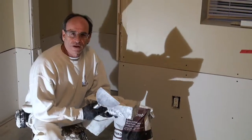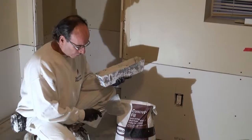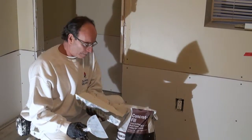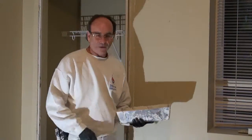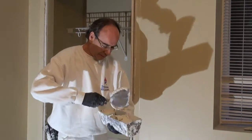I've got another video which covers mixing up this product here — concrete fill. What you need is a pan and a six-inch knife, a mud pan. I use about 90% concrete fill and about 10% regular mud so it's a little bit smoother.